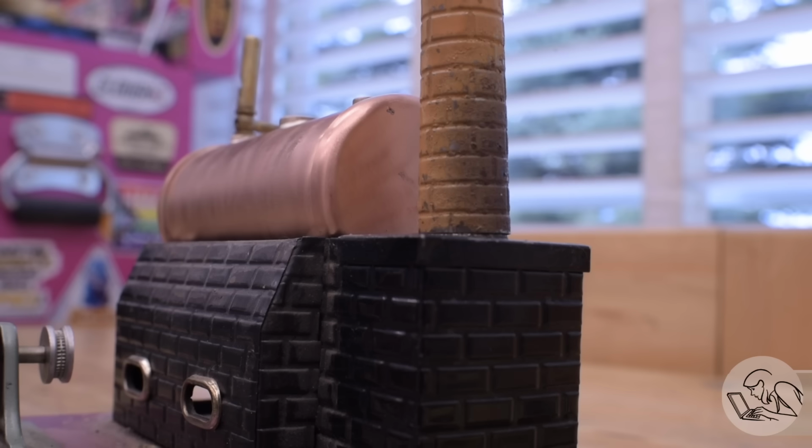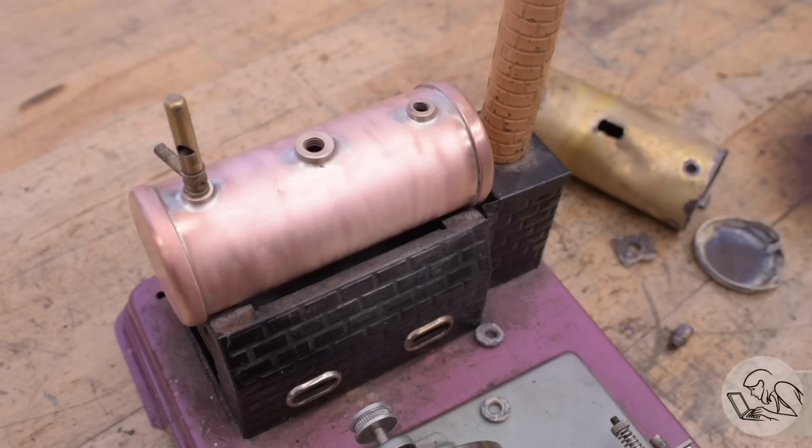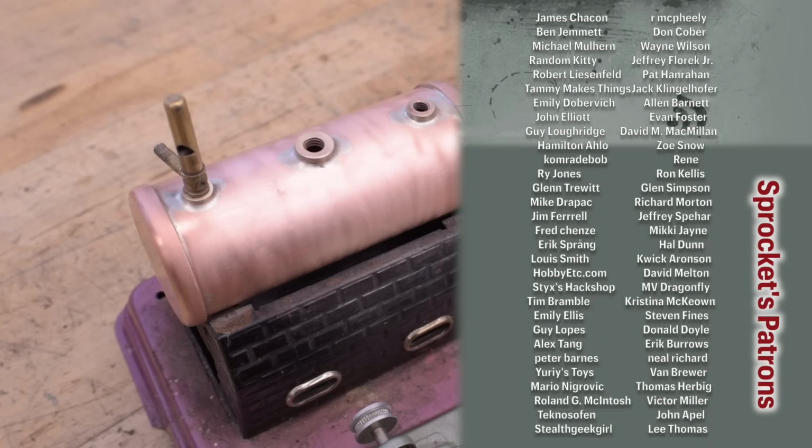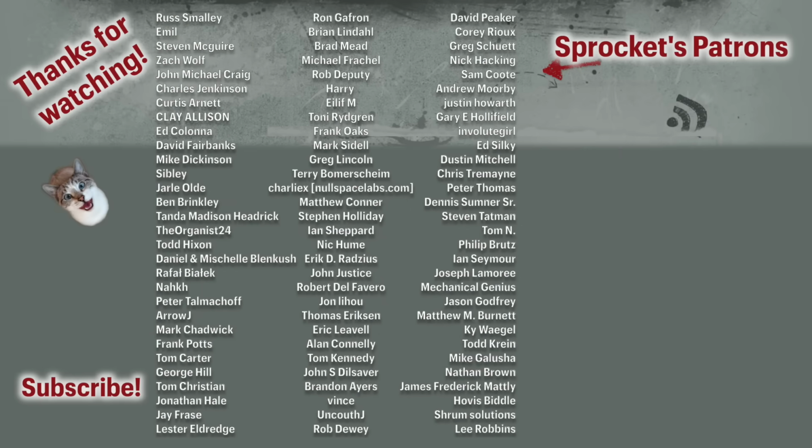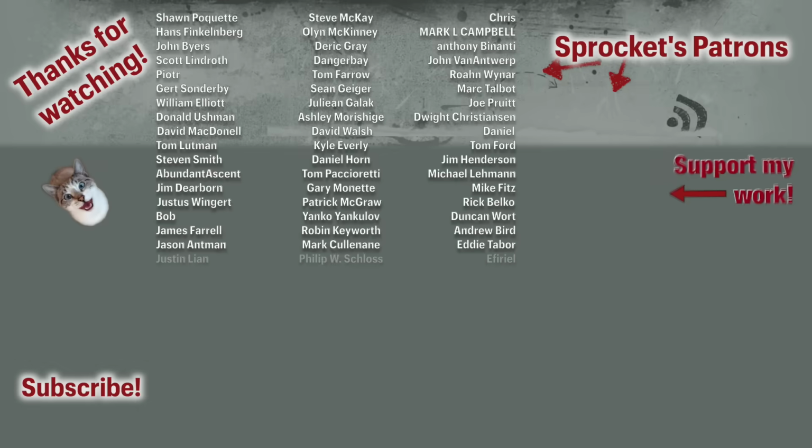But as nice as the copper looks now, the thing that YouTube never tells you about yellow metals is they tarnish very quickly. Within a week or two, this will be dark brown in color, and in 20 years, it'll be green. I've never found any kind of clear spray or anything that prevents yellow metal tarnishing. If you know of such a product, sell it to every boat owner in the world and you will be rich. So not decided yet on final finishing, but I'm still thinking about it.